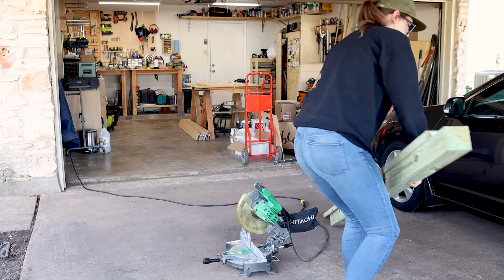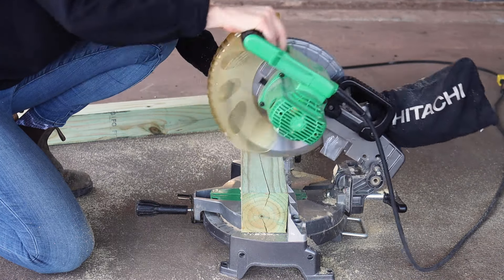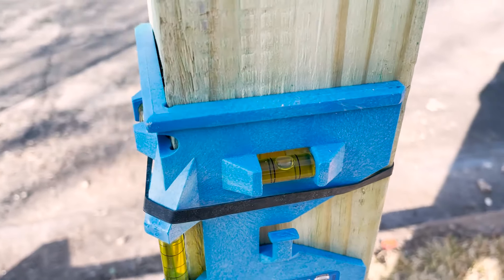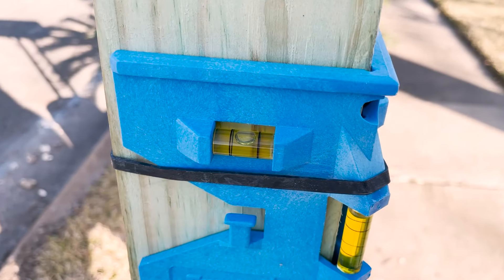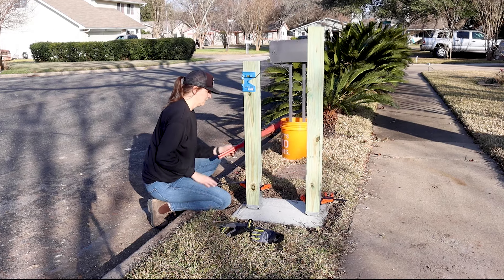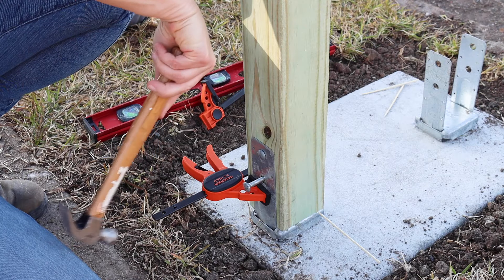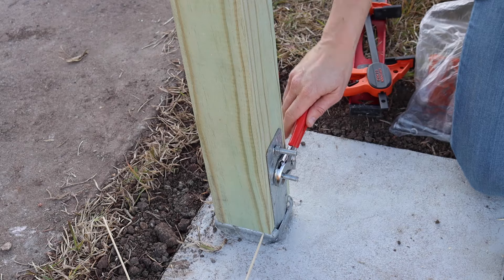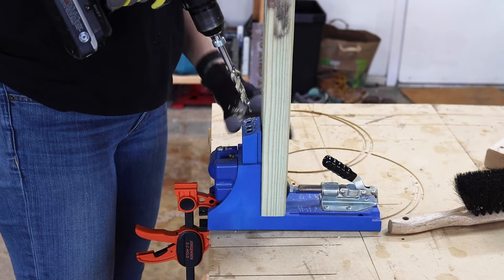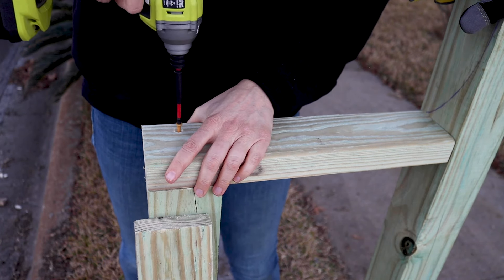The inside base of this mailbox is made with pressure treated lumber. I took a 4x4 and a 2x4 and cut them to size on my miter saw — I've got all of the dimensions lined out in the plans linked below. I set the longer post in the back and perfectly leveled it with shims, confirmed by a post level. I clamped it into place and then marked where the holes for the bolts will go, then repeated all the steps for the shorter front post. I drilled out the holes and put the post back in place and knocked in the bolts, which are galvanized for exterior use. One piece of 2x4 will connect the two posts and create a horizontal surface for the mailbox to sit. I added pocket holes on one side and then secured it into place with exterior screws on the opposite side.